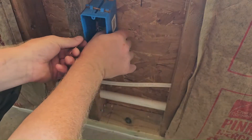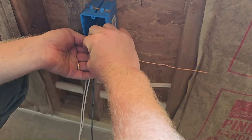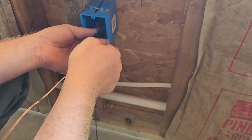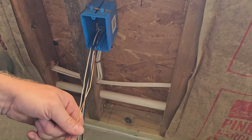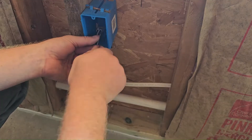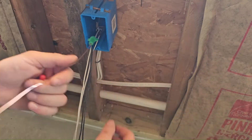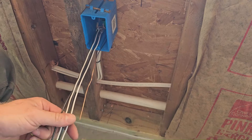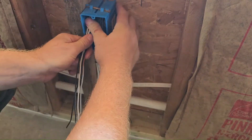Another way: you don't need to cut the wire at all. I don't even use wire strippers when making up grounds in a box. Simply fold it up and fold it down — you have all that length still. If you fold it and crimp it down, you can use a regular wire nut and it will still meet code because it's still a solid piece of wire. I prefer to fold it and use one of these green wire nuts, specifically designed for ground.